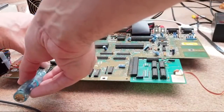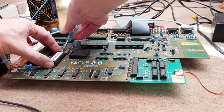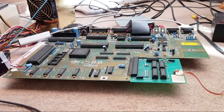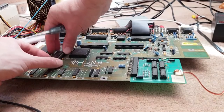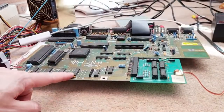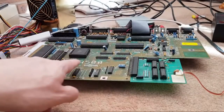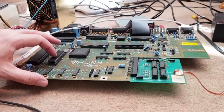Swap the ROM back over. I'm going to quickly swap out the chips one at a time from that other board, just to rule them out, because I think the RAM chips on the other board are okay. I think I've tested those previously on a board like this, because can you see these here? You've got 1, 2, 3, 4. You could probably, if these were socketed up, put these in here to test them, and vice versa. Is that the right way around there, Omia says?